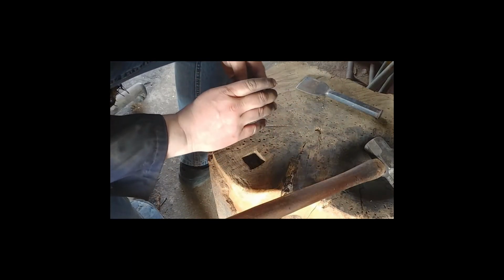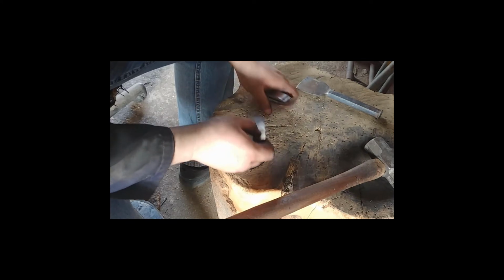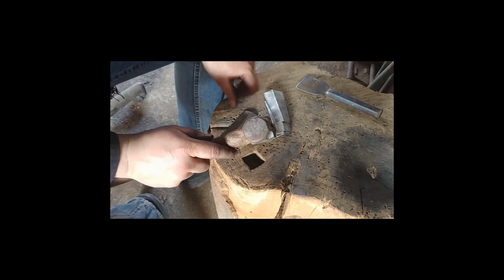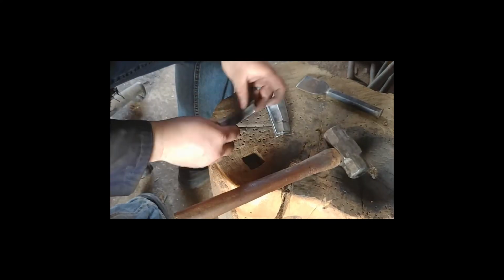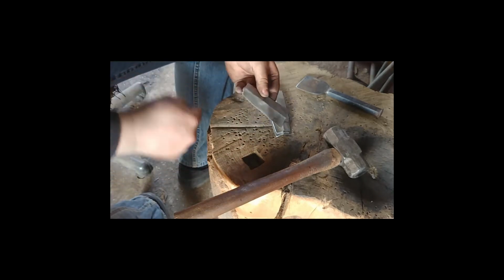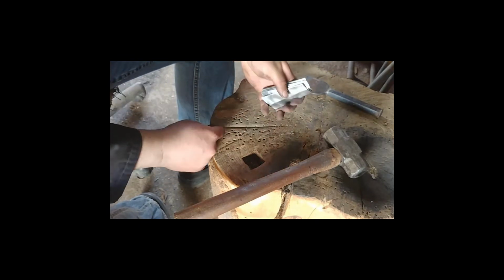So that's quite simple. What I'm going to do now, this is obviously a bit more of a tight curve. I just added that crease there because it increases the strength, because now you won't be able to bend it along that. I'm going to flatten it out a little bit, like that, because I don't want it to be so bent. But even though I flatten it out, it's still going to be quite strong because of that crease that's in there. So I can't bend it very easily. That's quite a bit of strength. That's just pretty much a strengthening rib. All right, so there's those done.